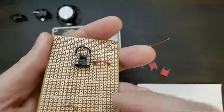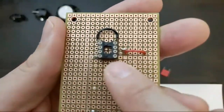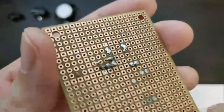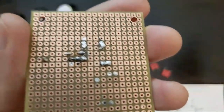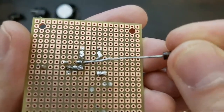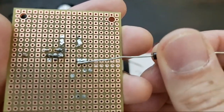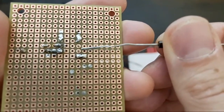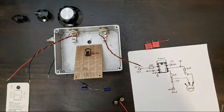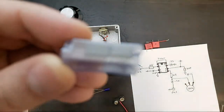As I was saying, I installed a socket here and a ground bus. We'll come back to the ground bus. I did not solder all the points to this socket yet. You can see a few are unsoldered. Here's where I soldered the jumper in to pins one, pin two. You can see that this is 5, 6, 7, 8. Pins 6 and 7 are unsoldered yet. We'll get to that. So the reason I installed a socket is because these chips are static sensitive. Get a close up here.